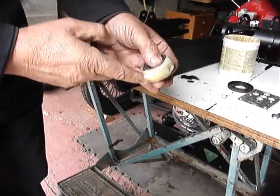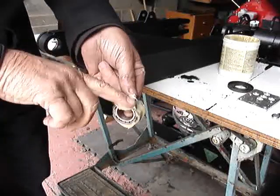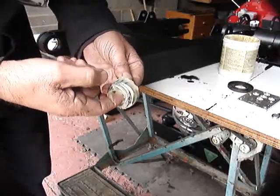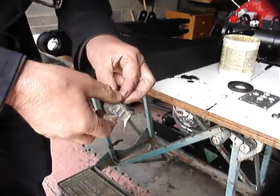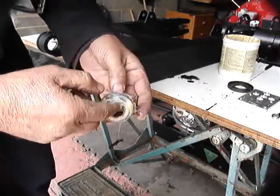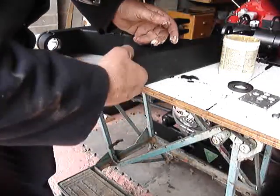Now we're going to thoroughly pack the inner part of the bearing and all its rollers with multi-purpose grease - something which should have been done when it was first built but obviously wasn't, which is why we've got all this trouble. We don't need to worry about leaving any air space as you would with a high speed bearing, because this thing's not even revolving - it's only rocking backwards and forwards in its own space. So with that nicely packed with grease, you can just pop it into place.